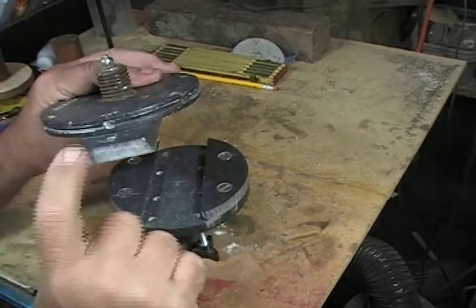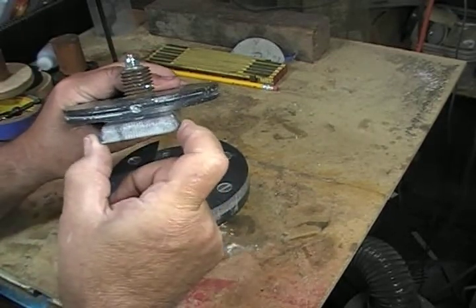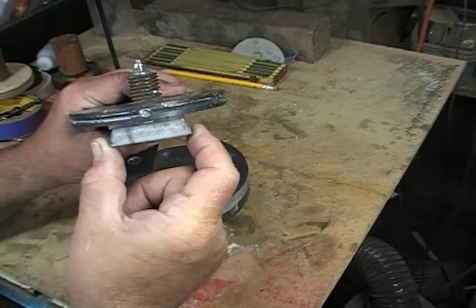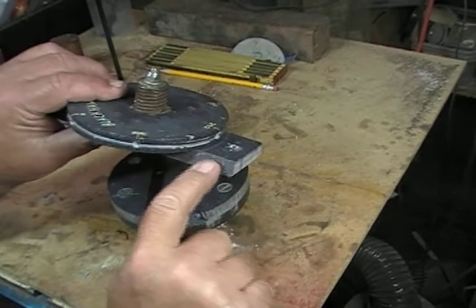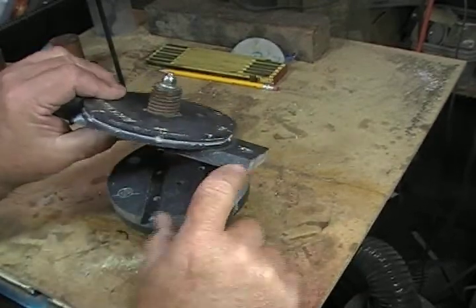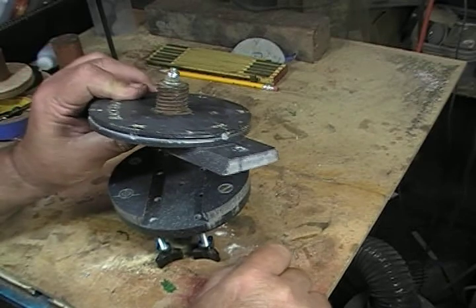This is the slide. You cut the slide first. You cut the slide 2 inches wide — 2 and 3/8ths is what this one is. Again, it's a pure 45. I sanded the Corian and polished it out, lapping on a flat stone, so it's good and straight and at a good 45.